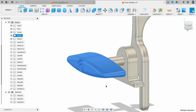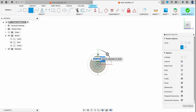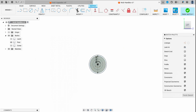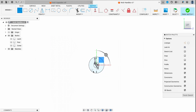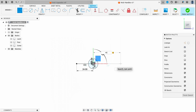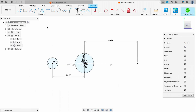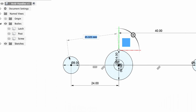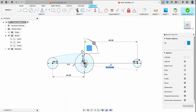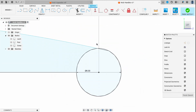The next piece we're going to design is this outside knob. I'll create a new sketch from the outside edge of the post, use the circle tool to draw out the height of the knob at 14 millimeters, then set the center radius at five millimeters to allow the screw to go through it. I want the front end to be shorter than the back end, so I'll grab the line tool from the center point, draw out 24 millimeters on the front and 40 millimeters on the back. This gives me points to grab a circle on the front end at eight millimeters and six millimeters on the back end. I'll grab the arc tool, sweep from the top radius over to the front circle, going just past it a little for a nicer fillet edge. You can now see we've got a nice airfoil shape to it.